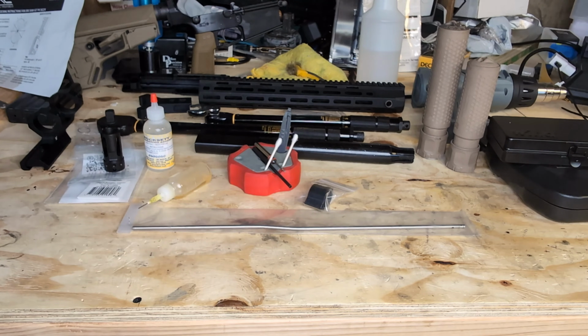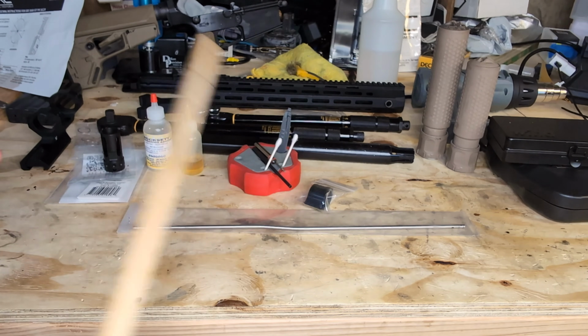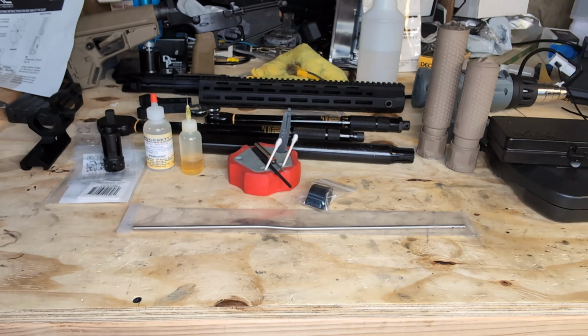And you want to make sure that your torque wrenches are high quality. If not, you know, you're going to be off. But you should get them calibrated no matter what. They're Lexivons from Amazon, and I've had them calibrated, so they're good within 1.5 foot-pounds of force.